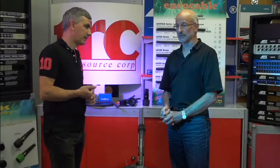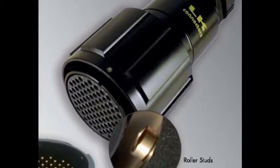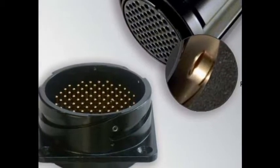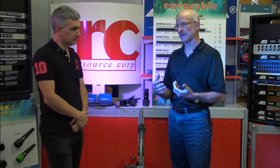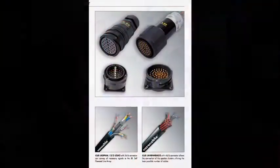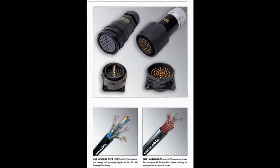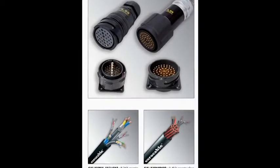Many people enjoy going down the multi-pin connector road, as it means it's just one simple, quick, takes seconds to connect so many channels in the one go, and you know all the phases are correct, you know everything is in order as it needs to be. In live circumstances, we get called on more and more frequently for the assembly of large multi-cores, so anything from 24 channels upwards to 48 channels or even 56 channel multi-core systems, and they may want to split or they have a long run for the front of house position.